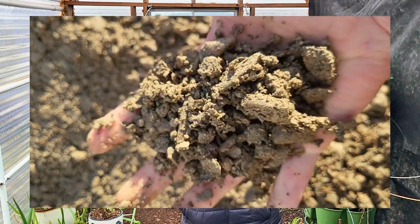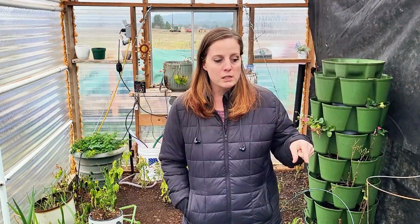Knowing we needed to stabilize the carport frame, we knew we needed a base. So we went ahead and we ordered some gravel that was compactable. I believe it was 3/4 inch minus to put around the perimeter where we knew the frame was going to be. After we put the gravel in, we got some posts to be able to tie the carport frame onto.